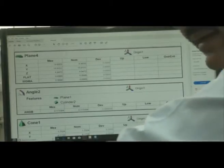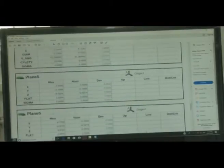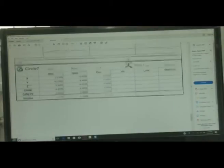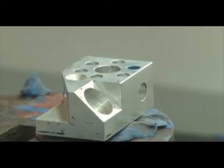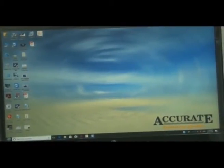Not only data and coordinates — we can also generate equations and 3D features from them. This shape represents a point cloud. Since this is a structured form I used manual operation, but we can also use CNC operation. In CNC mode, we set aside the joystick and command the machine to locate points automatically at each 1 mm or 2 mm interval.